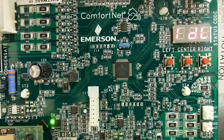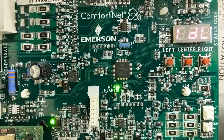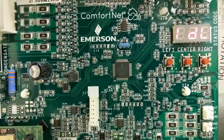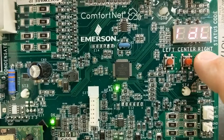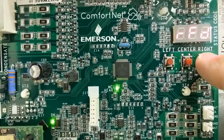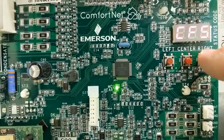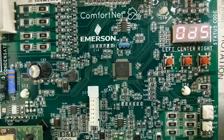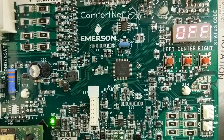The three seven-segment LED boards — sometimes the codes look a little unusual but these are pretty straightforward. The left and right buttons scroll, and the center button is for selection. We need to set up this non-communicating unit, so first we scroll until we find ODS. You can see why I promote the app, because scrolling around takes a few seconds.